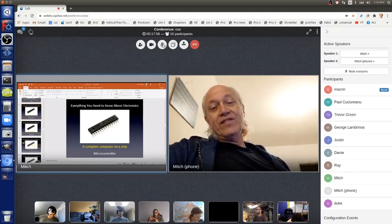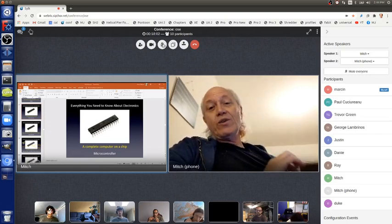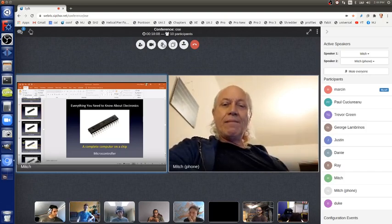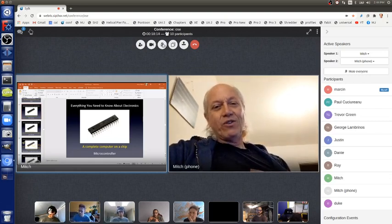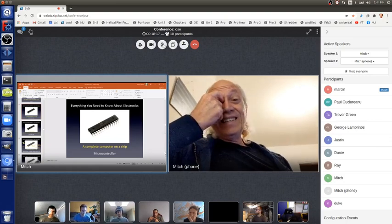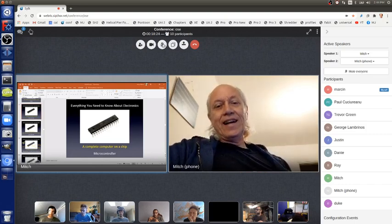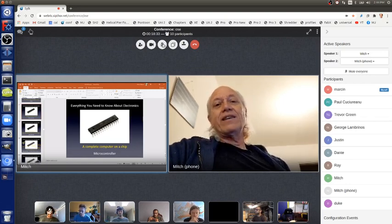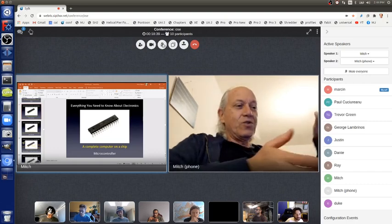I'm not going to go over that today, but there are good tutorials online to show you. Instead of buying that special hardware, which costs about $20 to $35 or euros, you can program an Arduino to be that special hardware. That's called a microcontroller programmer, and the Arduino software is designed to be able to use that as well as one you would buy. There are tutorials online for that, and if you want to do that later and have questions about it, totally feel free to contact me, by email or phone or whatever.